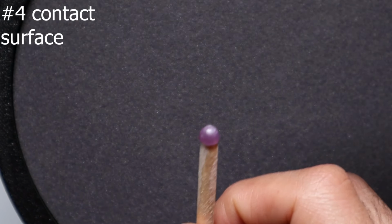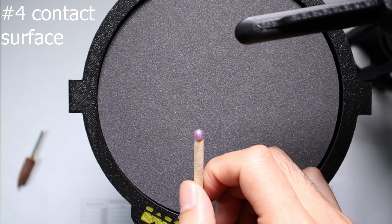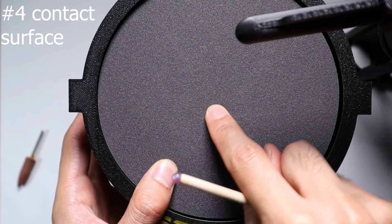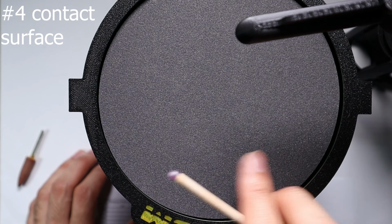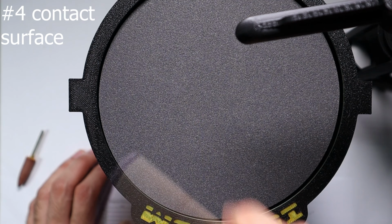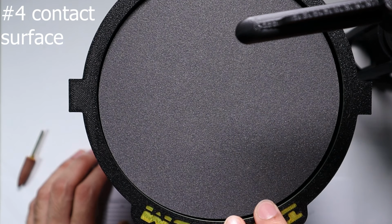Now, it doesn't necessarily have to happen with a flat lap. If you're using electroplated plates, it's much more likely. But if you've got something like this spongy, soft sandpaper backed with foam, here you can actually avoid it quite well. So you don't have to get a lot of those flat spots because it's much more forgiving. But otherwise you have to be really careful of those flat spots. You can make a full contact with this entire surface all at once if you've got a big enough stone.